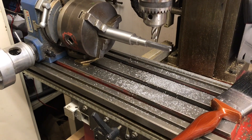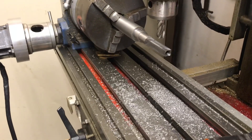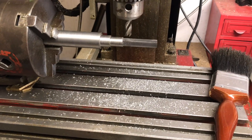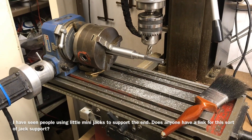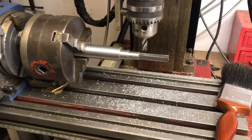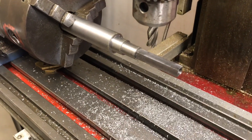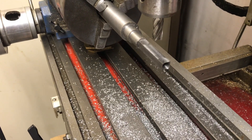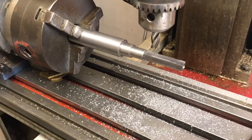I did this bit off camera, partly because I had low charge but partly because I know I'm going to get heavy criticism for it — yes, that's sticking out and I milled it. Of course I should have used a tailstock, but I just don't have one with my rotary table and as much as I'd love one, at the moment I can't afford it for so little use. Anyway, it worked out very well. It took very, very light cuts and it took me ages, but I think I've ended up with a nicer square — that's obviously the turning square for winding — and quite a nice finish, certainly nicer than I would have got with filing.